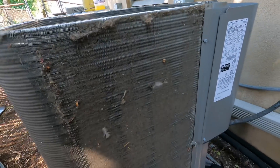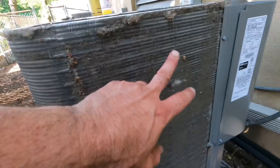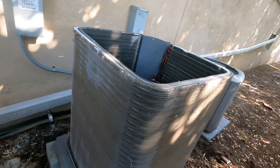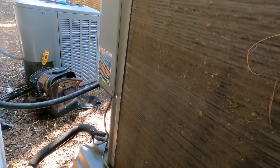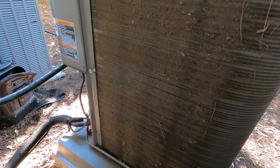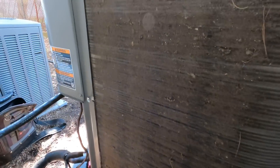It's only about 80 degrees outside and I had 340 head pressure, but you can see air is really not getting through this too well. A lot of the coils are like that. Air is still fighting its way through, but it's mostly around the coil, so it's just heating up and heating up. Look at the debris in the back — that is pretty ratty.